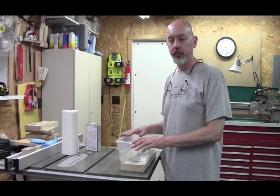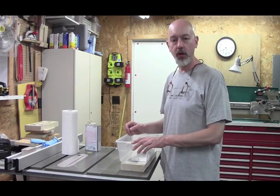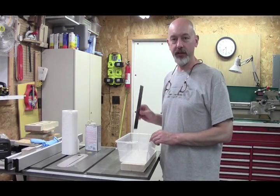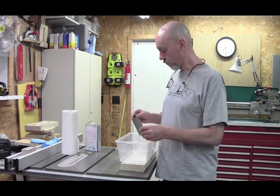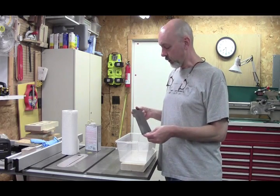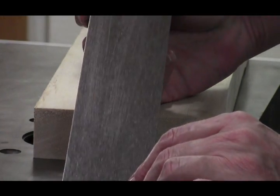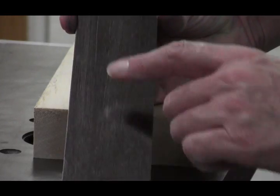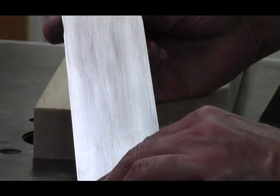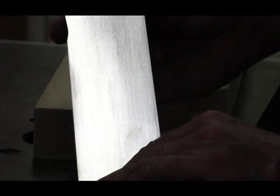The citric acid worked. I put it in and thought I'd grab a soft brush and help it along, but by the time I walked through my toolbox and grabbed a toothbrush and walked back, there was no blue left on it — it was maybe 30 seconds. So that was a pretty good money investment for a couple of bucks for some citric acid. After it came out, the bluing is pretty well gone. It has a little bit of a tarnished look to it, but after some 320-grit sandpaper it shines up pretty nice.